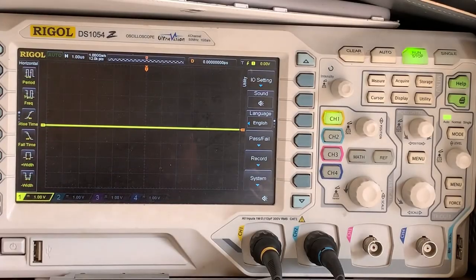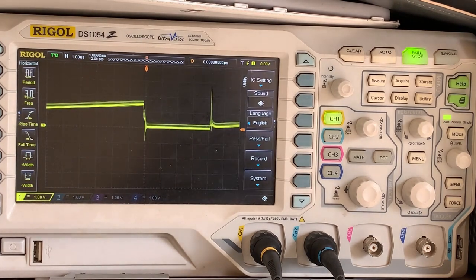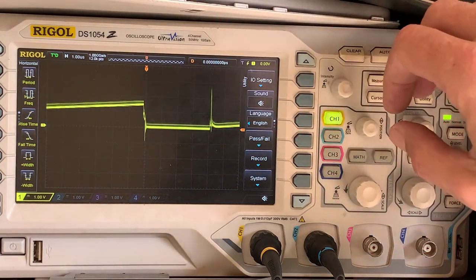So here's our scope. Our device is off. I've unplugged the main board, so the only thing that is now happening is we've got power coming into the power board. The power board is driving the LEDs. In other words, the pulse width modulation dimming control from the main board is disabled. As we can see, when I switch it on, there comes our pulse waves. Well, actually not. What we're seeing is channel 1, the yellow channel.